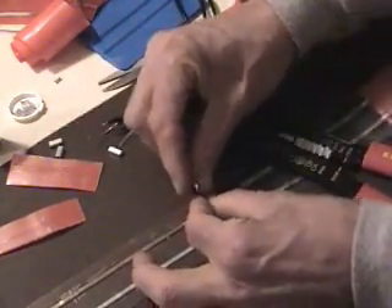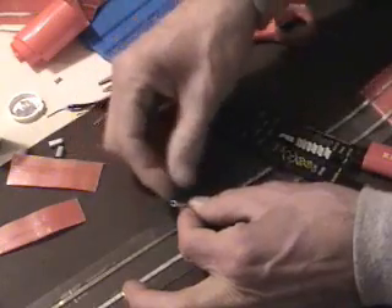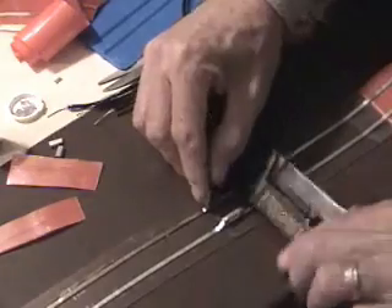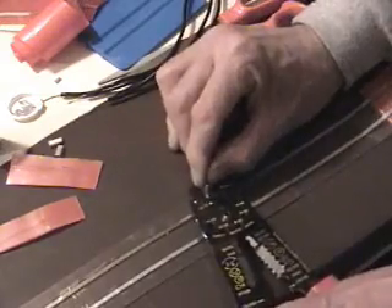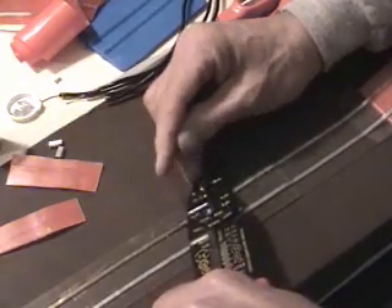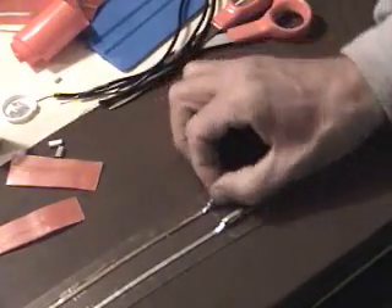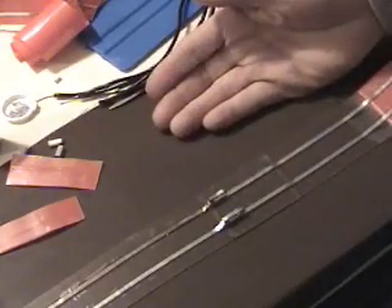Let's get the other set of wires here. Try to get a good alignment on those — when the wires align, the crimp goes over very nicely. Once again, do not allow the crimp to go all the way down to the tape; leave it slightly above the tape. That helps us in the folding process. First grab it around the middle and crimp it, then grab it around the top and crimp it. Lay it down to the tape, fold the wires over the top, and you have a nice spliced tape.